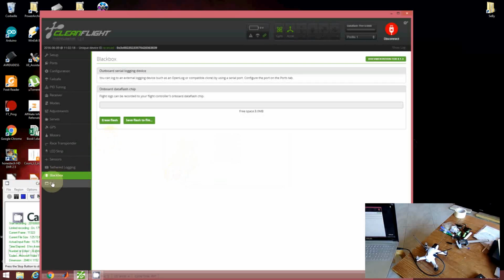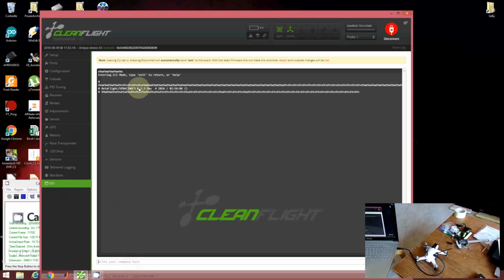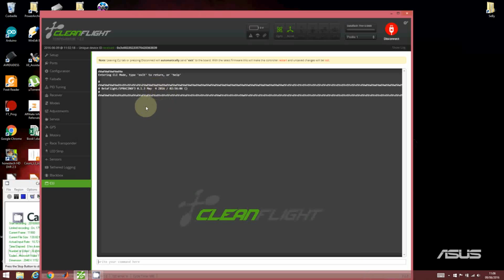We can also show you the default version. So this is version 1.3 of the 4th of May of this year. It's an SP Racing F3 board, with the last, very recent firmware associated. Be aware, the firmware is specific to the F115 Rodeo, so don't flash, for example, the common latest version of Betaflight. It's a dedicated version, so be aware of it.